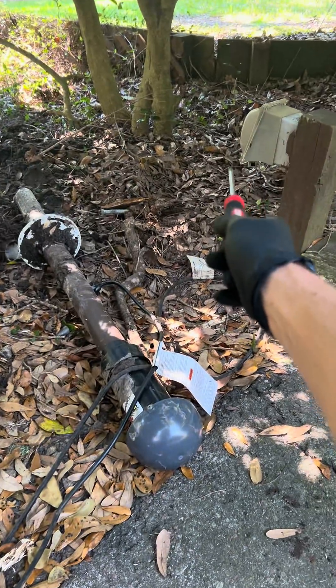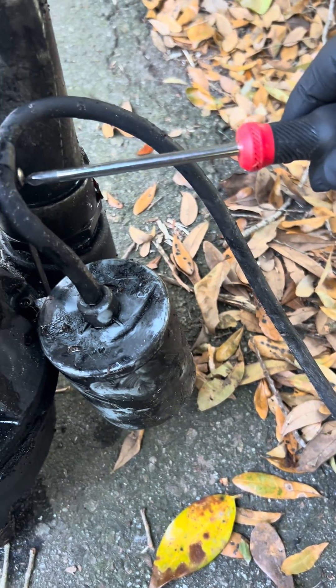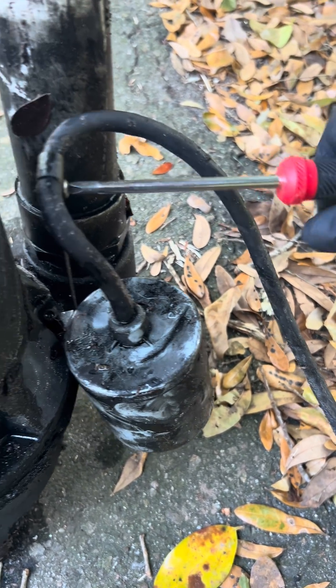So that's about $400 saved. Also, whenever you test the piggyback, verify you have power — if you need to, plug something else in like a drill or a fan to make sure you have power, because you don't want to replace a float and realize you don't have power.